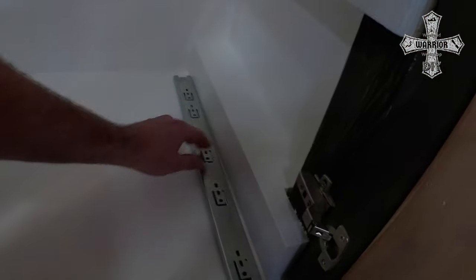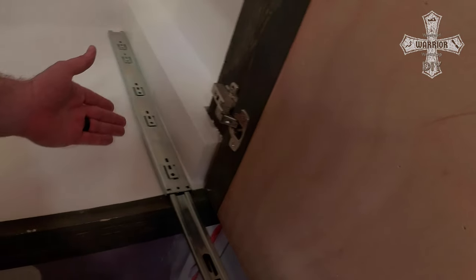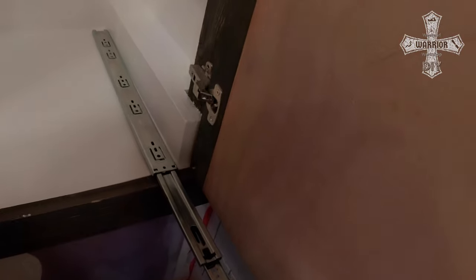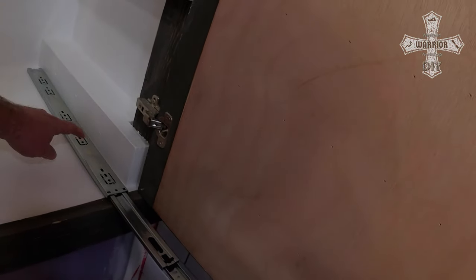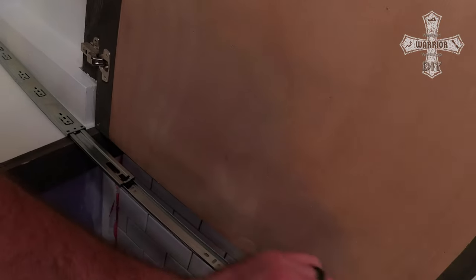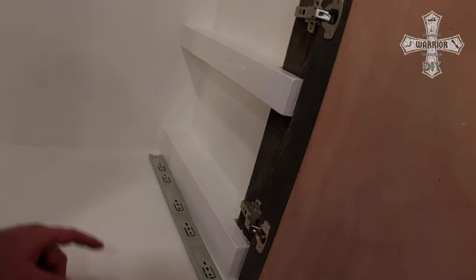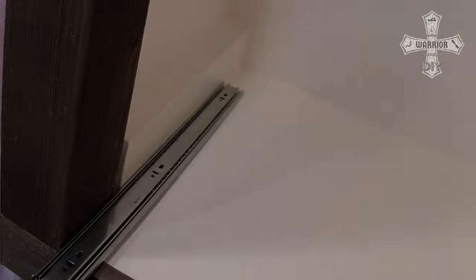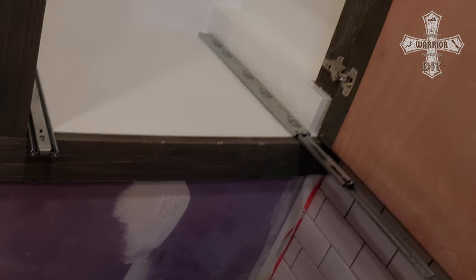I have a door in the way here, and if I keep the drawer slide connected I wouldn't be able to screw it in from this side. So what I want to do is get the back piece installed in the wall — these drawer slides are separable, with a front piece that attaches to the drawer. I'm going to measure the drawer for that piece. If I get the back piece mounted to the wall level, and then attach the front piece to the drawer at the same distance all the way down, theoretically when I install that drawer it'll be nice and level front to back.